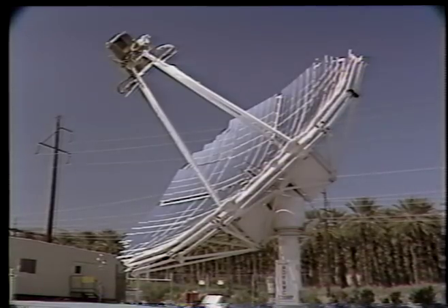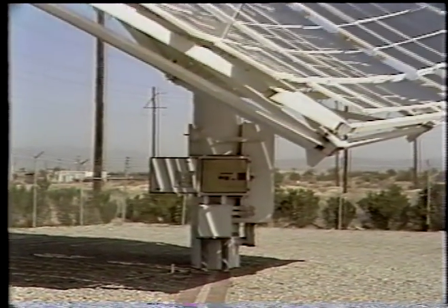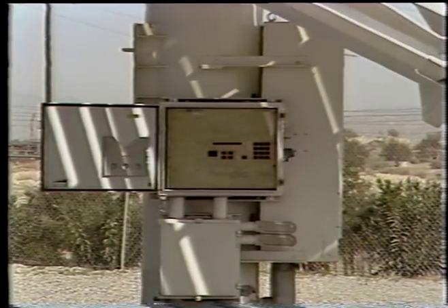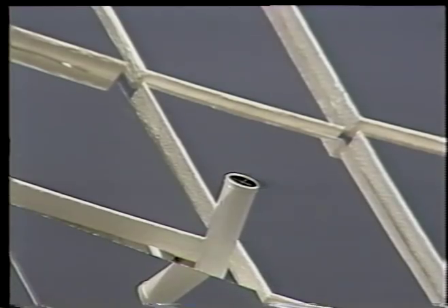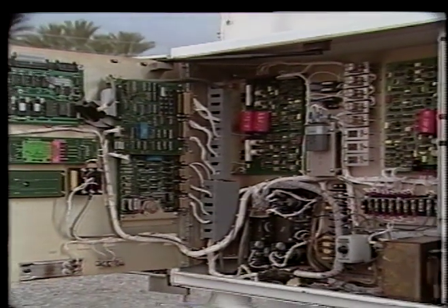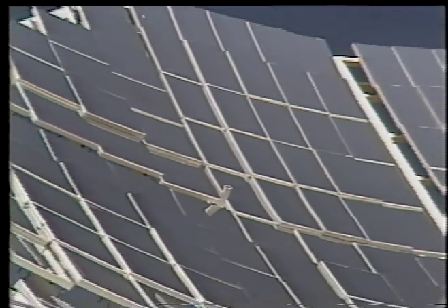The EGM maintains a tracking accuracy of three one-hundredths of a degree and consumes very little energy to operate. Tracking and monitoring of safety functions is the role of the subconcentrator control, or SCC. Synchros are used on two exocentric gimbal axes to report angular position, while sun position is determined by a solar sensor. The SCC analyzes the data and executes the necessary tracking movements to follow the sun from sunup to sundown.